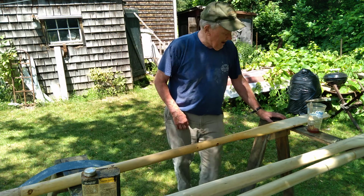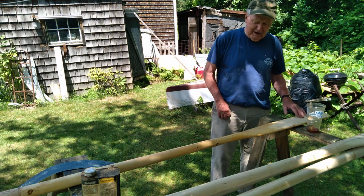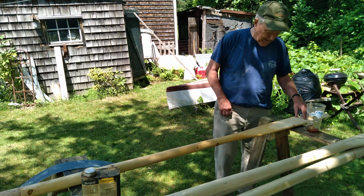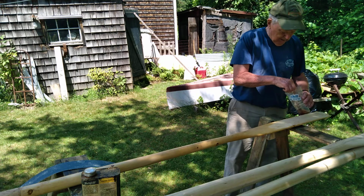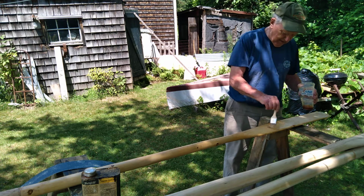The blade is a hot part. You want a blade no bigger than a half an inch thick at the end. You want to get weight off down here. I've gone down to under 5/8 to 1/2 on these.